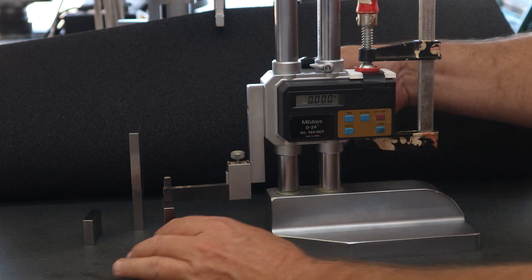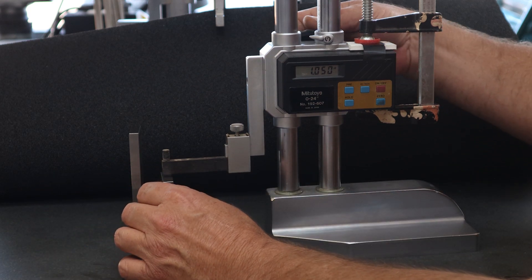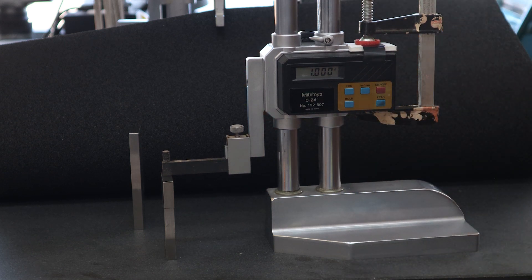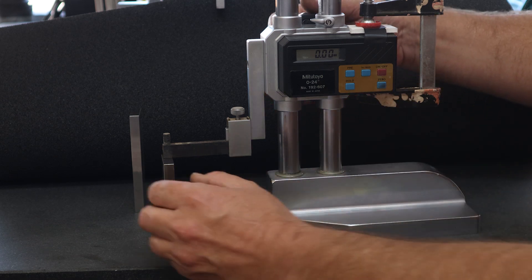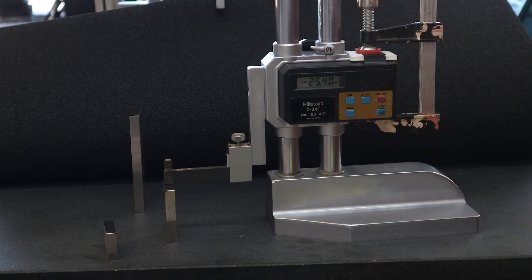Come down, zero out on a 2 inch gauge block, come up, stack a 1 inch on top of that, comes back down — we've gone up 1 inch. That's ideal for this type of gauge at the price point. We've taken it completely apart, cleaned it up, got it back together working just fine. Please subscribe and thanks for watching. I'll switch it over to millimeter — raise it up a little, come back down, make sure we're zeroed. We should be 25.4 millimeters away — 25.4 millimeters. Working good in metric too.